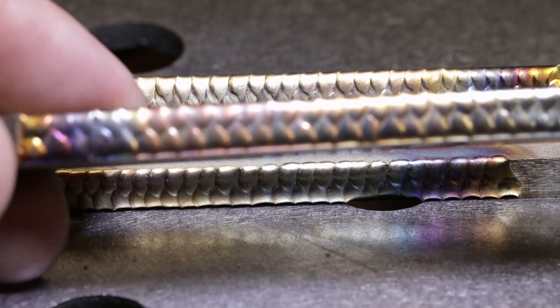An exercise I do from time to time is taking some bar stock and weaving the edge of that bar stock — typically about a quarter inch wide. The beauty about this is you get really good at edge control. High pulses per second are going to keep that puddle planted so you can get really close to the edge, dab your rod, move to the other side, and you're not going to blow that edge out.